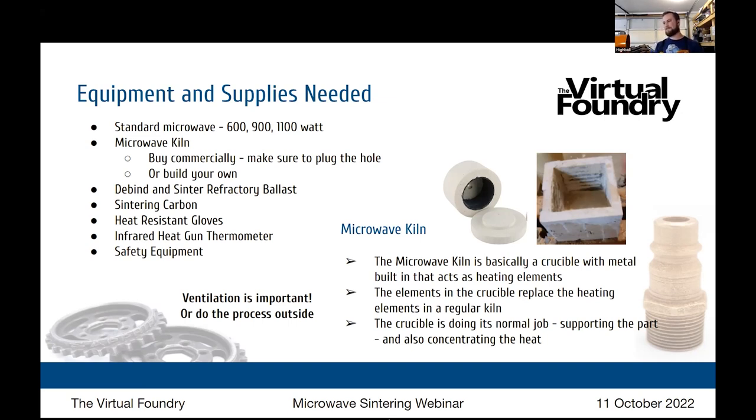Highball, you described a calibration technique where you put your microwave on low and then just ran it to see what the maximum temperature it would hit. I thought this was a pretty interesting strategy because you could calibrate different microwaves using the same solution. Yeah, and it's not much different than the old cones that they use in ceramic firing. They've been using those for well before we had fancy equipment to measure. Just by knowing where the cone slumps, that's the max that you achieved. So this is a similar approach to that, just finding out what that rate is and benchmarking it to your hardware, to the different temperature settings. It seems to be working well enough, at least well enough for me to continue.